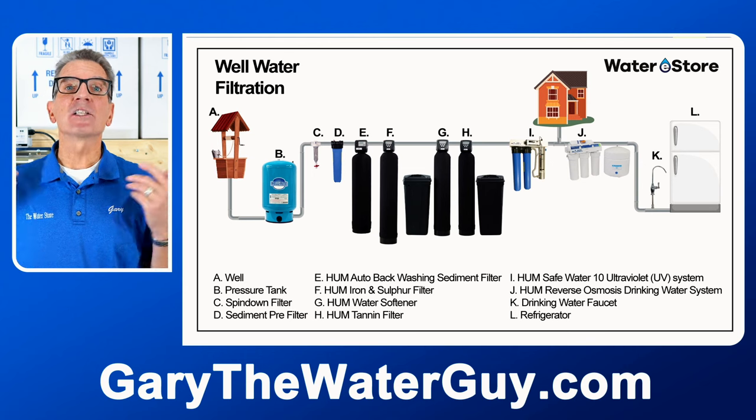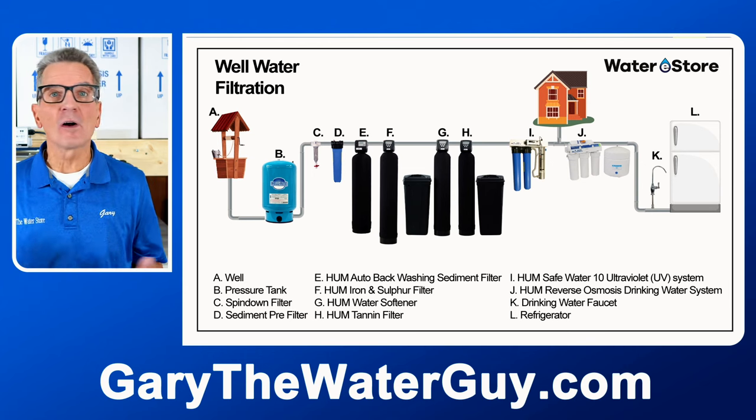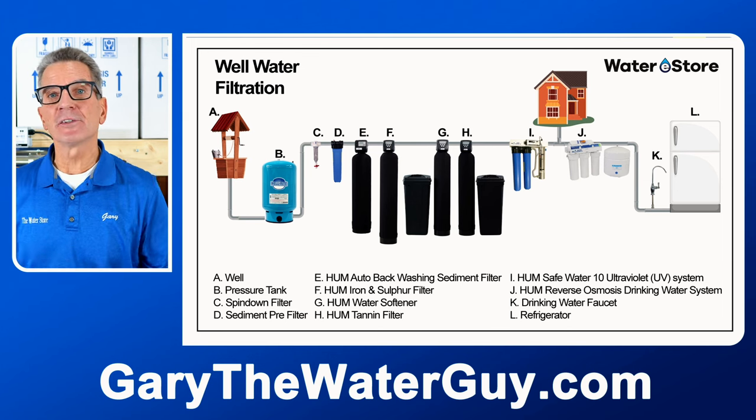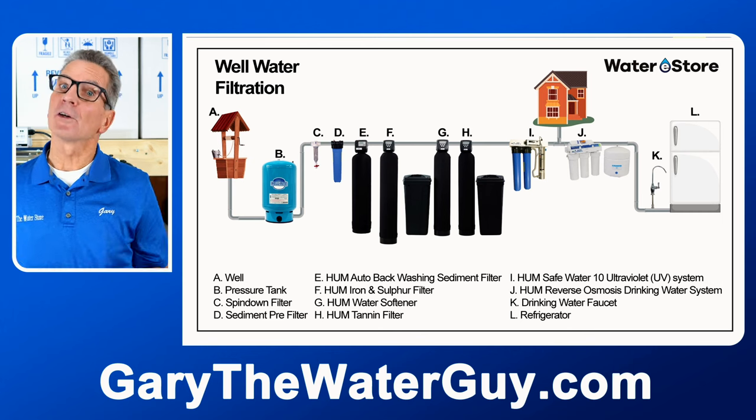Another thing to keep in mind is where this ultraviolet disinfection system actually gets installed. It gets installed after all your other water filtration equipment. After the water softener, iron filter, tannin filter, whatever else you have, then it goes through the UV light, then it splits into hot and cold for your home, cottage, or cabin.